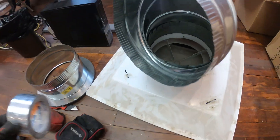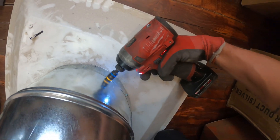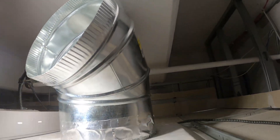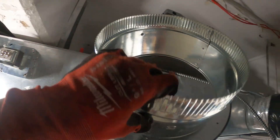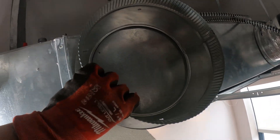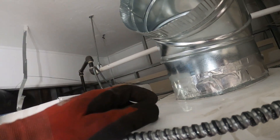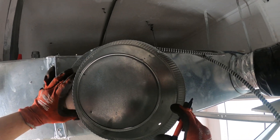We're going to drop in a few screws and tape it up. That's in place and looking good — perfect fit. This is our supply. We've got a little transformer here so we need to get a takeoff right here. We're pretty close. This is a 10 inch takeoff — it is a bit larger but it should fit just well. The only reason we're using this is because we wanted to take this diffuser from the other room which is 10 inches. Let's set this up so everything is going to be alright.